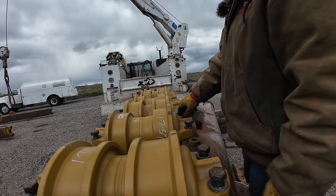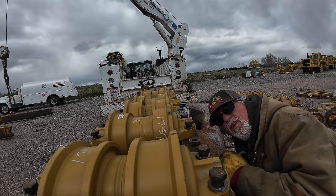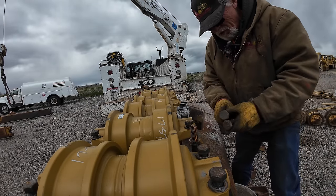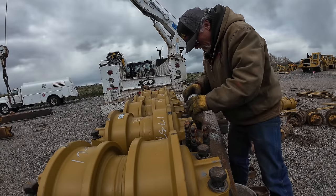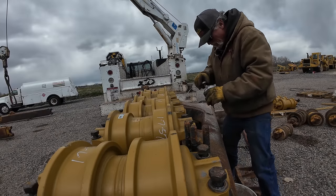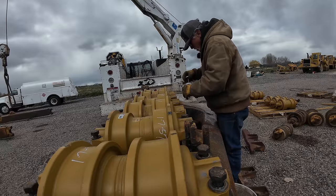So what's wrong with my Ingersoll? It could be a battery issue, because I saw on that torque test channel that they changed the battery in one of their electric guns. It wasn't a 1-inch. I think it was a half or 3/4, something like that. They changed the battery to a different battery, and the torque curve went through the roof. And so it may be that the battery just doesn't have it. But my test was a real world test, and that's what you're interested in. If it makes 2,600 foot-pounds of undo torque, why wouldn't it undo these bolts?